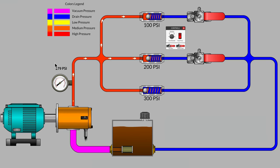Does that sound like an efficient way to get hydraulic flows to occur on more than 1 parallel branch? No, it does not. But it is common enough. It's not usually done by undersizing hoses or oversizing pumps as much as flow on 2 parallel branches may be achieved by opening directional valves on each of these 2 branches only slightly. But a directional valve that is opened only slightly on this branch and only slightly on that branch is the same thing as having undersized hydraulic hoses in the simple analysis.